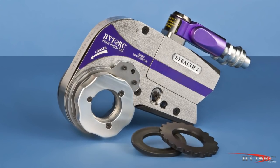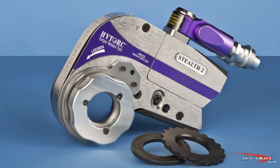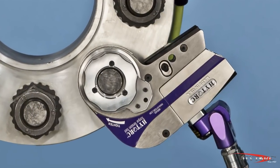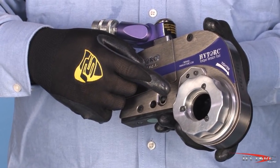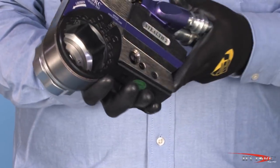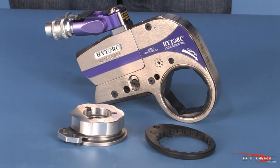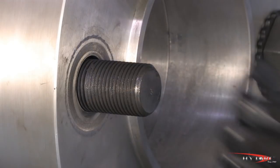The second method not only allows the new high torque washer to be used in areas where the Z-Gun will not fit, but it allows the simultaneous use of multiple tools to ensure parallel flange closure, and it works hands-free, even upside down. The secret is a simple, ingenious retainer that attaches to the powerful Slimline Stealth hydraulic wrench. The retainer kit consists of a thin reaction plate to hold on the new high torque washer, a companion tool holding plate, and a simple retaining nut that secures the unit onto the stud.